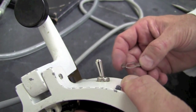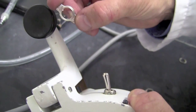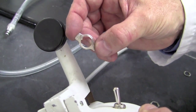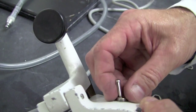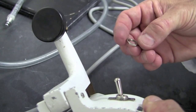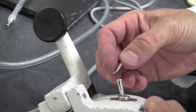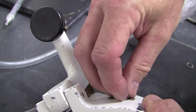Now that I've ensured that the toggle switch is in the off position and facing towards the vibrator arm, I'm going to take the indicator plate and take the corresponding off indication and put it in the off position of the switch. The next step is to take the hex nut and secure that in place, first by hand and then with a wrench.